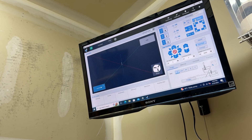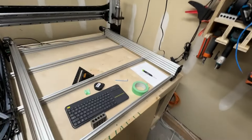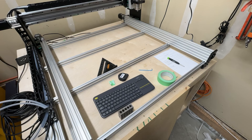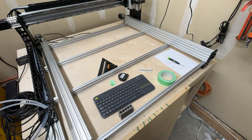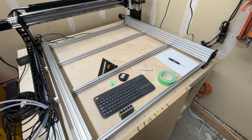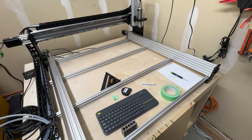So hopefully this was helpful. I've got the machine calibrated for steps per millimeter and extents set for X, Y, and Z. I do have some MDF down here but it's not quite big enough — I'll cut another sheet. I'm still deciding what to do for my spoilboard, so if you have recommendations on your workbee setup, let me know. I'm planning on MDF but haven't settled on a specific method yet. Thanks for your time, hope you learned something.